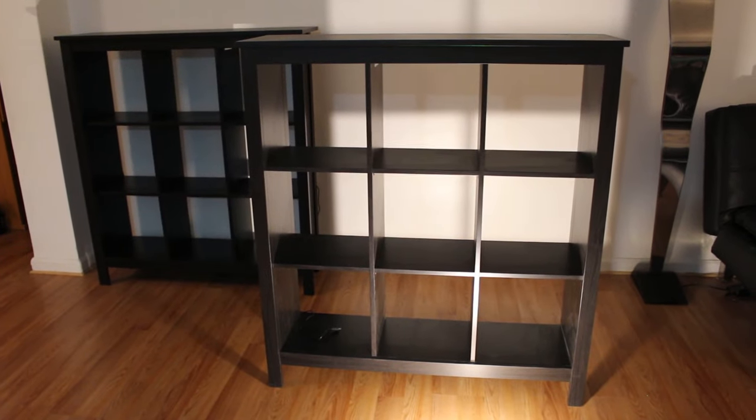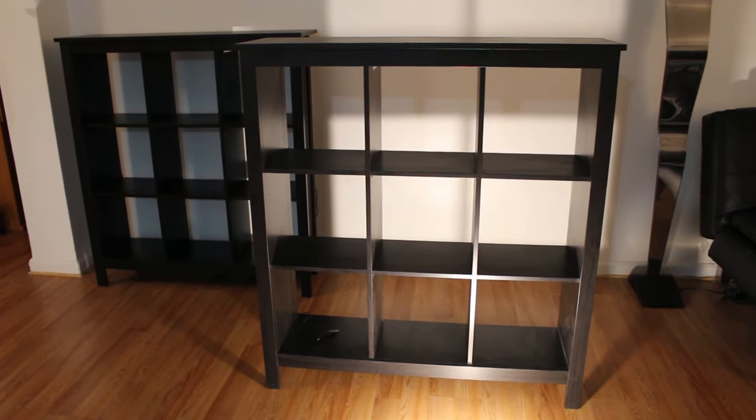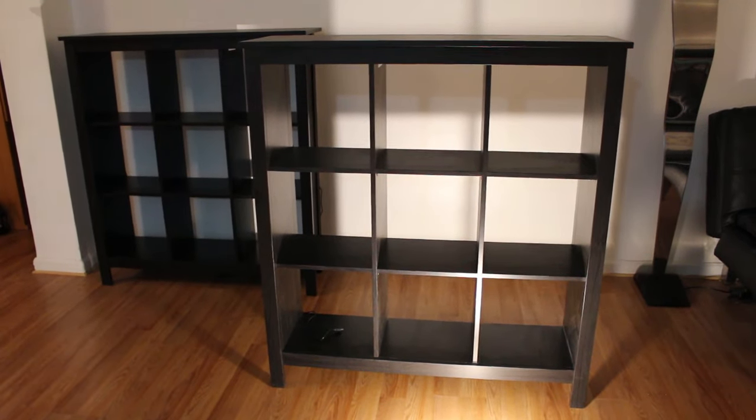From the outside perspective, you cannot tell any holes were made, you can't see any wires, and you can't tell there's any lights there, and that's the product that we want. So if we look closely, here our power comes in here. I tuck the wires all in the inner corners. I also use these little plastic clips to hold the wires. As far as the LEDs, I use the adhesive tape.